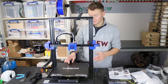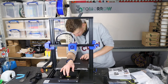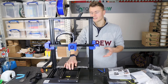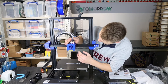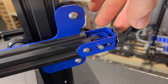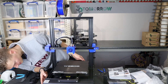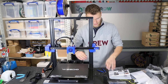It does make it slightly more difficult to load the filament because of the extended Bowden tube at the edge. It then says to check the tightness of the belt — just manually, that it has a degree of elasticity, which it does. But it doesn't say anything about what you're supposed to do if it's too flappy — there isn't actually a way to adjust the tightness of the Y-axis belt, so you'd have to print a little tightening clip. For the X-axis, there is a very easy way to adjust the belt tension, which is nice — considered for X but not Y. Also going to check the voltage on the underside, and it is set to 230 volts, which is fine for the UK.